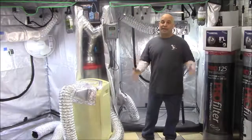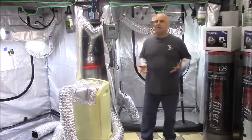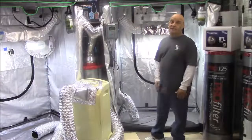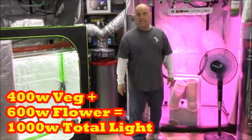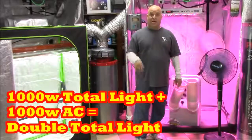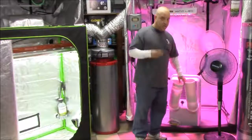The proper way to vent is the least amount of air necessary, not the most. And that's also why putting the fan filter on the roof doesn't vent any more heat. All that's great, unless you consider the cost of electricity — because if you've got a 400 watt veg and a 600 watt flower and you add a 1000 watt AC to that, you're going to double your electricity costs, whether it's a one duct or a two duct.